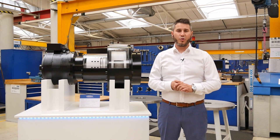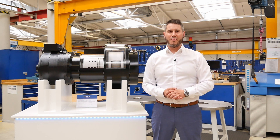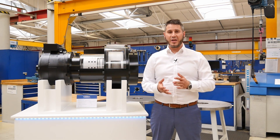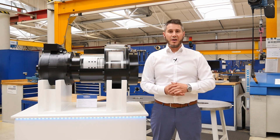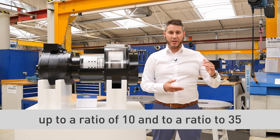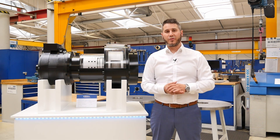common high-torque synchronous motor. For the planetary gearbox, we use our long-term experience in the development of gear solutions for heavy-duty applications, like our well-known Servox technology for mechanical servo presses. The planetary gear can be executed in one stage with a ratio up to 10, and in a second stage with a ratio up to 35.